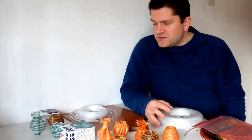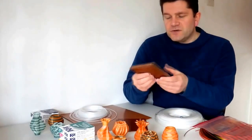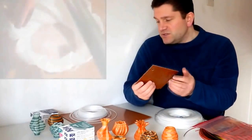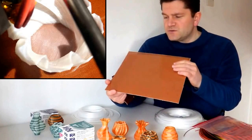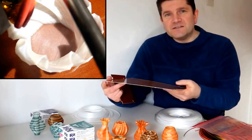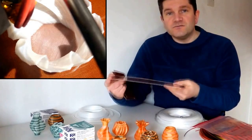One of the things to note is that you don't need a heated bed to print on. You can actually just print on blue tape, or the best material is anything cellulose-based — so wood, various woods. You can print on laminated woods; these are pressure laminated with resin and they work really well. The best material that most people found is tufnel — that's what it's called in the UK. It's a weave of cotton impregnated with resin, a very strong material with cellulose fibres that the nylon really likes to stick to.